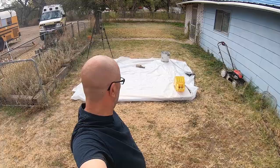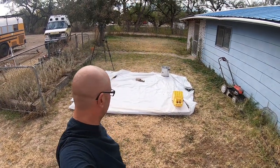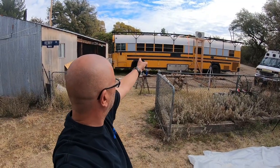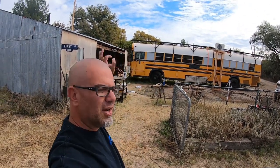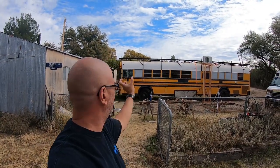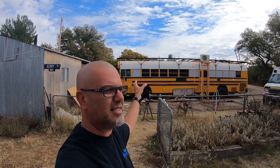This is our wood that we bought, and we covered it in plastic, and thank goodness we did, because our first little winter rainstorm came through. You can see all the little ribs going across. Each one of those is measured out so that a seam will fall on a 2-inch piece, so I have something to screw into. We're putting a ton of screws into these things to make sure that this stuff doesn't blow off and kill a bus full of nuns and stuff. So that's the project today.